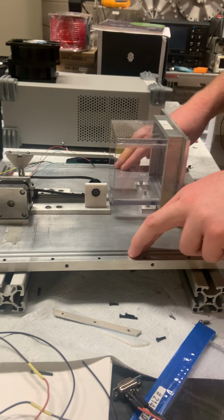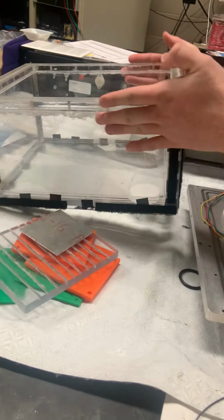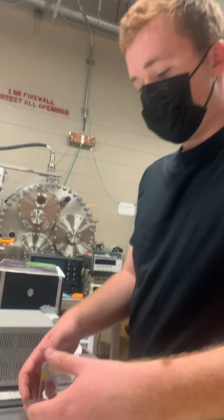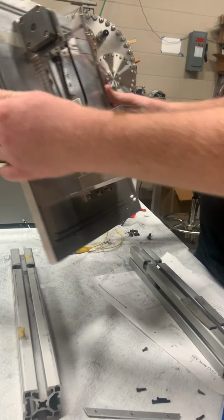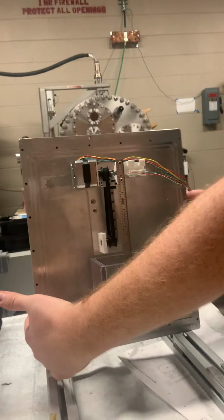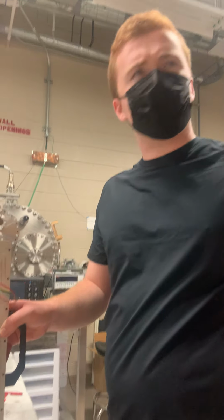These two grooves hold O-rings here, and this polycarbonate box seals over the top of the O-rings. So it's totally airtight? Yeah, completely airtight. We're pumping down to about 1,000th of an atmosphere. And this is going to be positioned upright in a frame where it has about 4 of these boxes. No, 4 of these entire units, in a big frame. It's about 3 feet wide.